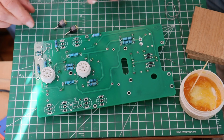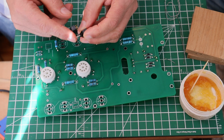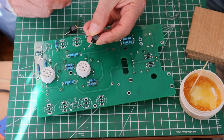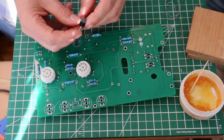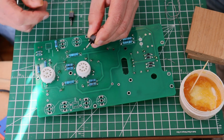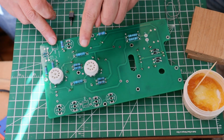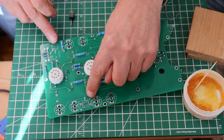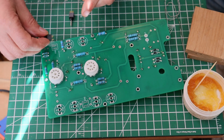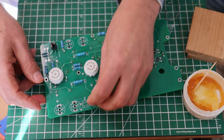So, the first thing is the switch has 3 positions. It can go to one end or the other end, or it can go to the detent position. So when we're soldering it, we want them in the middle position. That means no heat is getting transferred between the contacts on the inside. Now, the switches go on the side of the board the sockets are, and they're marked SW2 and SW3. So that's the side that we're actually going to install them. And they can go in either direction. It doesn't matter as long as they fit into the solder holes.